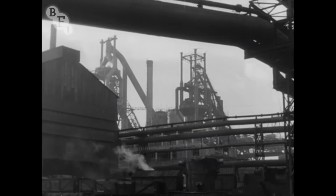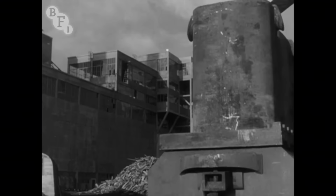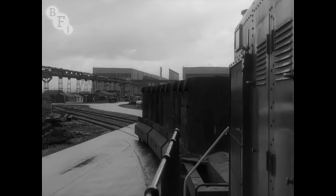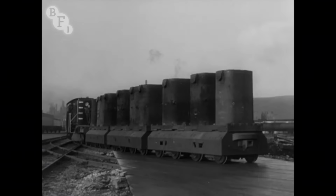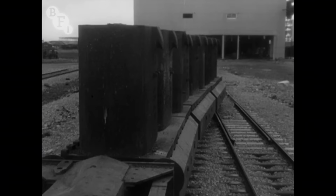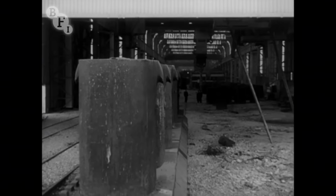But until the Abbey melting shop was ready, the melting shop at Margam could supply steel ingots for the Abbey mill. Here is a train of ingots passing the washery, travelling back the way the conveyors came, alongside and across the road from Margam to Abbey. This is a 90-ton diesel electric locomotive shunting the train. Now the ingots near the ingot stripping bay, the first stage in that 3/4 mile journey, which in the end will convert 20-ton steel ingots into 600 yards of strip, a tenth of an inch thick.